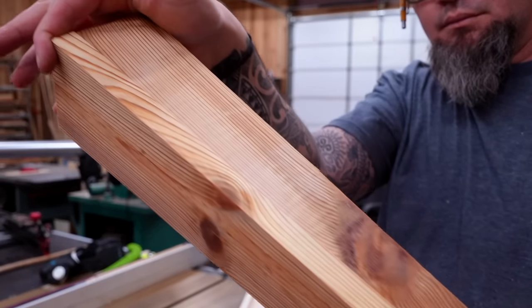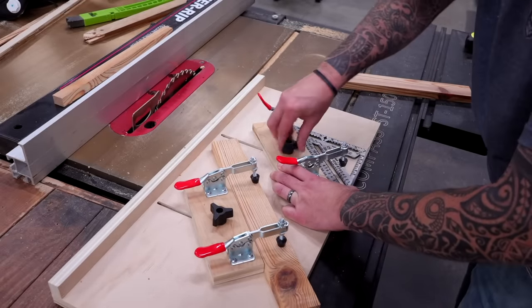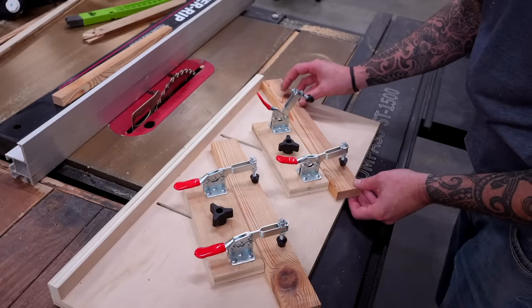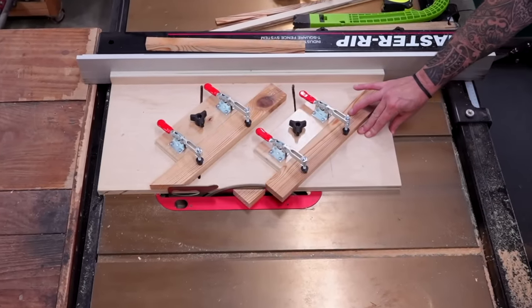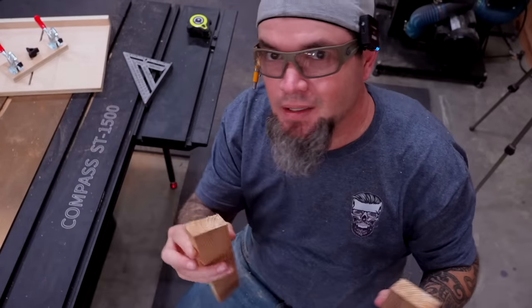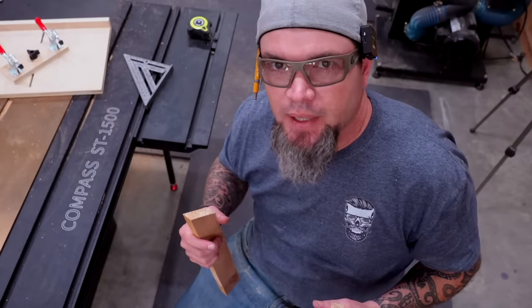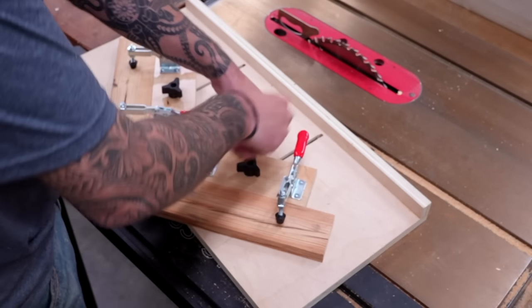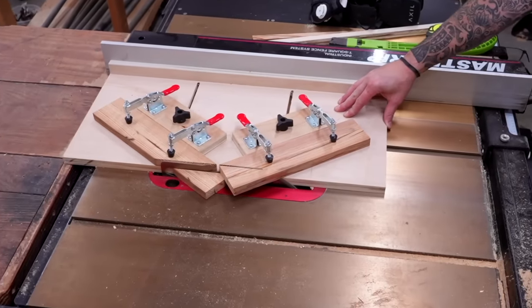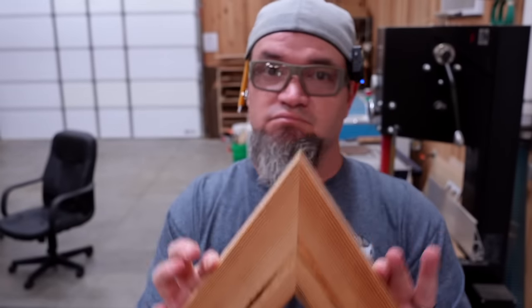You can also use it for a tapered two-piece three quarter inch leg. For non-traditional uses, let's talk about cutting 45s — all you have to do is set your clamps to 45 degrees, hold those down, and you can even cut two pieces at once. We have perfect 45s. But what about super acute angles that our miter saws won't cut — like 70 degrees? For a 70 degree mitered corner, that's 35 degrees per side. Set it up just like the 45s except at 35 degrees, and there's your super simple 70 degree miter. You could even bevel the saw for super acute mitered bevels.